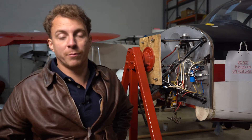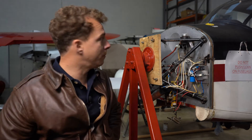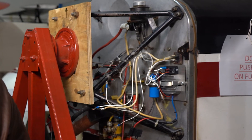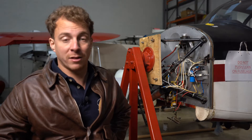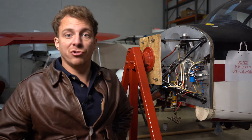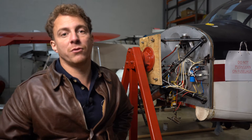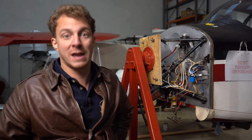When an engine comes off the production line for the first time, or out of a fresh overhaul like this aeroplane's engine has, you have to run it in. Although the manufacturer's operating manual should be consulted on how to do that for that specific engine type, as a general rule of thumb, engines should be run in on straight mineral oils for at least the first 50 hours, or until engine oil consumption stabilises.